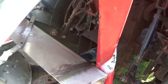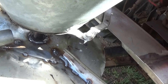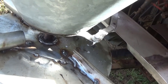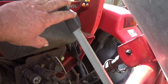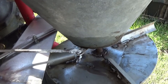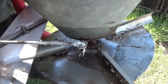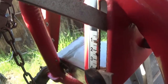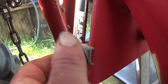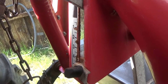Now I'm going to put some fine sandy gravel in it, start the tractor and spreader up, and open the little gate to see whether it works. This handle here comes down and opens and closes the holes in the bottom of the spreader to let more or less fertilizer, seed, or whatever you've got come out. On the front there's a little gauge, and you can adjust a stopper to set it to a certain amount.